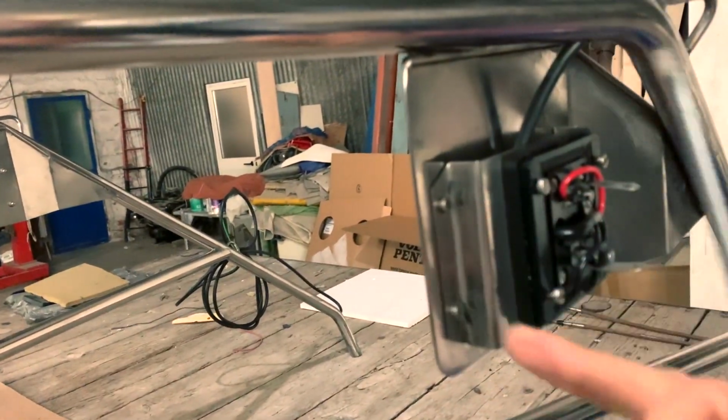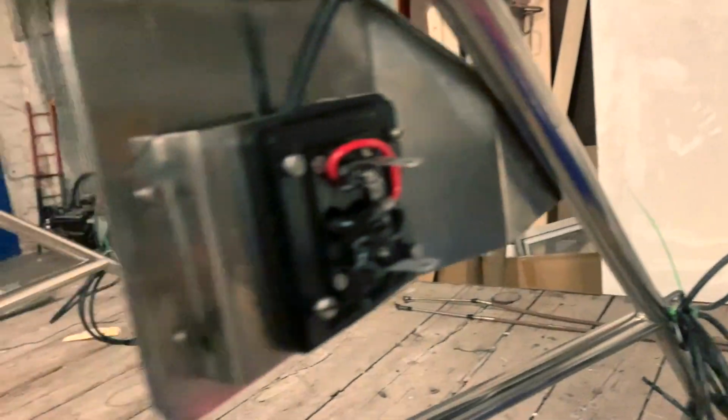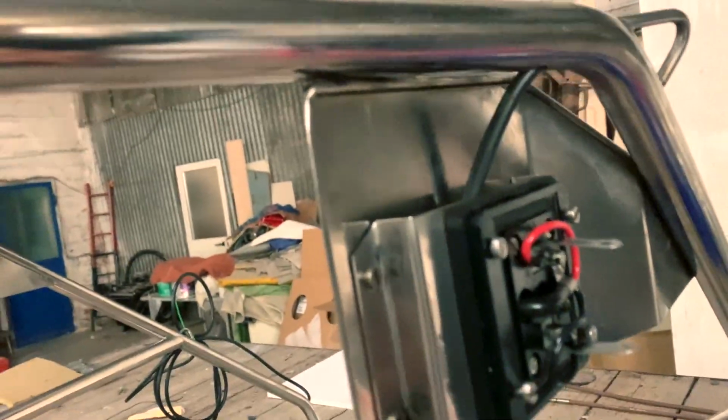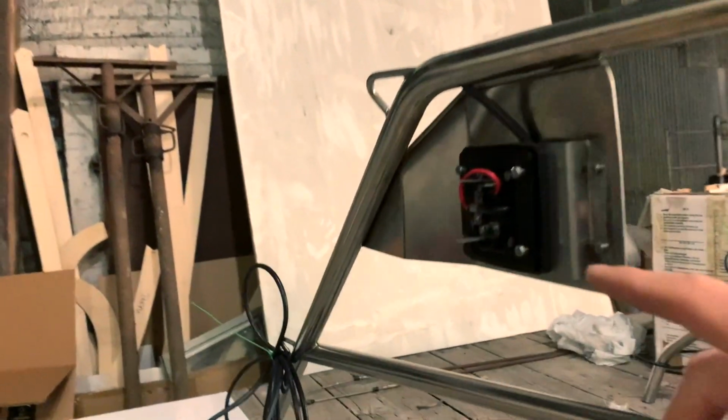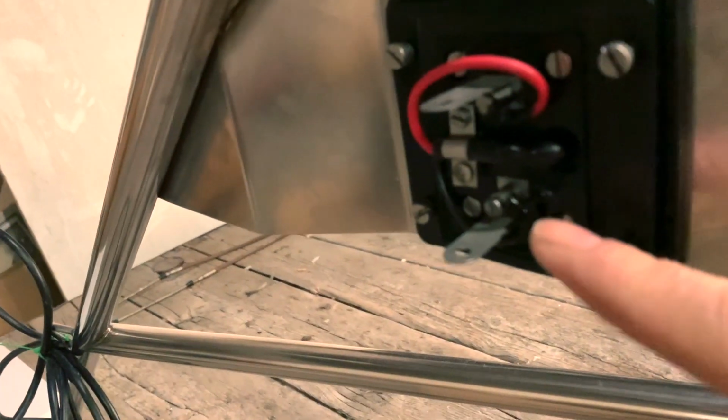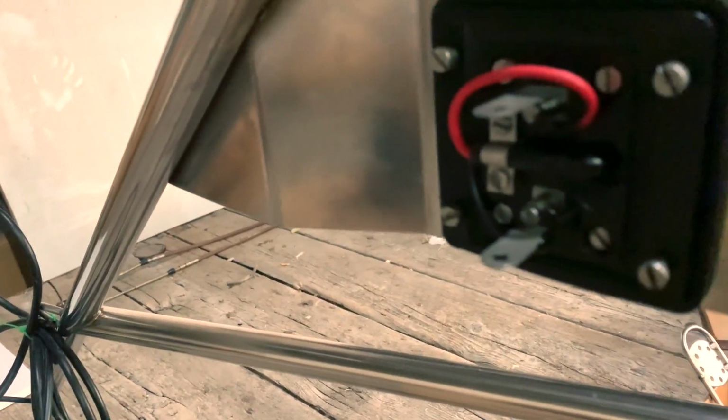Meantime, I start to run all the cable inside the bow pulpit, because now I'm installing all the running lights. I always use very good quality cable, the thinner one, and I also use LED lights, so I have very low consumption. Also, I protect all the connections with this liquid tape to avoid any type of problem in the future.